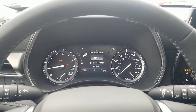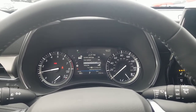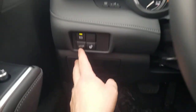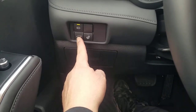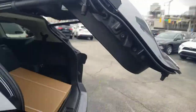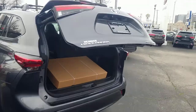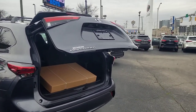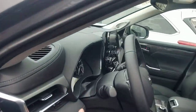Now you'll see I can actually change this adjustment to whatever I need for whatever reason. Let's say I'm in a carport and maybe I need to go to a three. Now that I've done this, I'm going to go ahead and open this door, walk back here, and you're going to see that the door — without being jam protection — has stopped right here. So you can change where it stops; you can change where it goes up to.